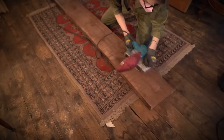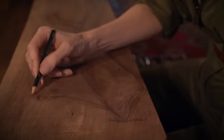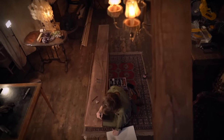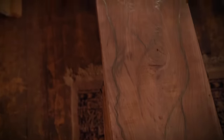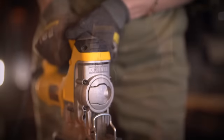Now that I know what I'm going to be making, I need to draw this out on the board. The board is extremely rough, so my very first step here is going to be sanding this smooth so I'll actually be able to use a pencil on it. Once I had a base silhouette I was really happy with, I can now start taking a jigsaw and go around all of those lines I've penciled in. I should mention that black walnut is a hardwood, so it's really, really tough to get through — I did have to work very slowly.